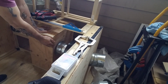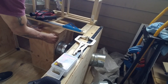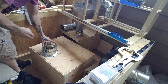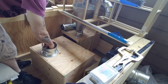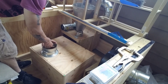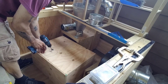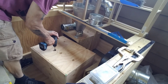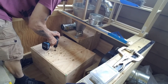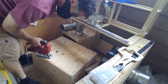I slid the box into place and lined it up with the inline blower to mark the hole — a six-inch hole right there. On the top of the box I need to put a four-inch hole. I marked where the six-inch takeoff is going to be located on the inside and outside so I know where the flange will ride and don't cut into it. I took a half-inch Forstner bit, cut a starter hole in the circle, then inserted the jigsaw blade and cut the hole out.